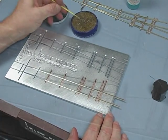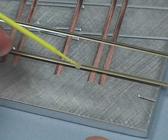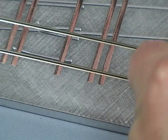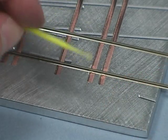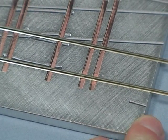The trick is to use just a little bit, and I'll show you how much we use when we do the solder joint here. I've gathered up a little bit of flux on the tip — just moisten the tip a little bit. I'm going to put a little bit on here and a little bit on the back. You can see how small an amount I used — it was just enough to dampen it.